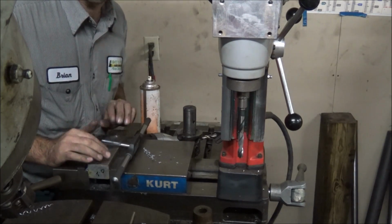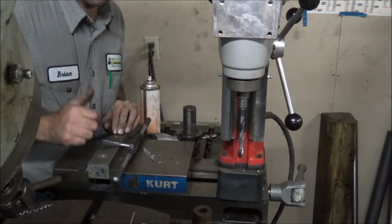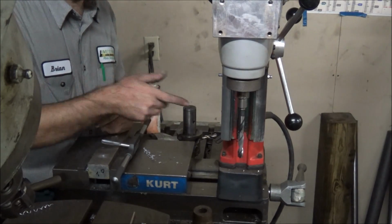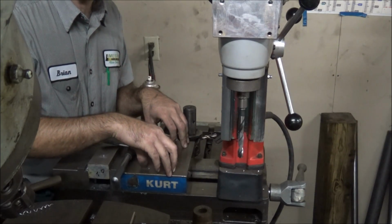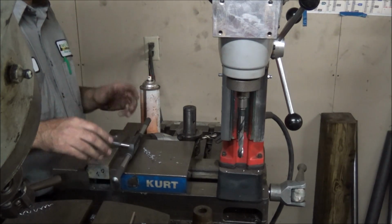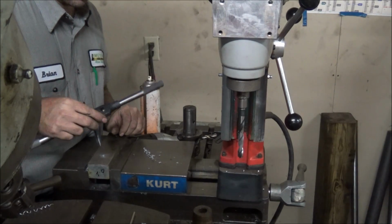So I figured some of y'all would probably get a kick out of this, since I don't own a drill press and I'm still not finished cutting these hemispherical plates. Decided to make a drill press here today. What I've been doing is I can just take the drill, mag it down on this flat spot on the cart, and I can drill these holes out in these pieces without them all moving around. So this is my mini mill drill, I guess. Just thought y'all would like that.